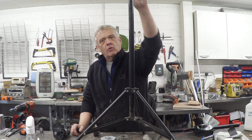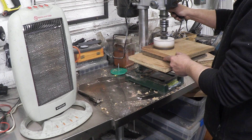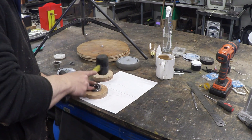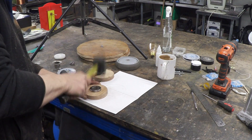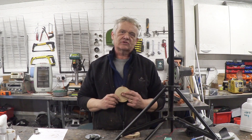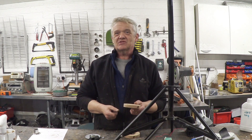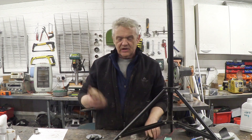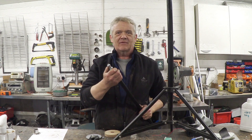We need something on there, then we need to be able to drop the top on, fit the sails, and hey presto we'll have ourselves a collapsible wind turbine. So let's make something that we can hang the sails on — it's going to be a circle. I've made a couple of 200mm wooden discs and you can see I've just sunk some bearings in there. I've got a hole in here and here, and those mysterious holes become obvious later.